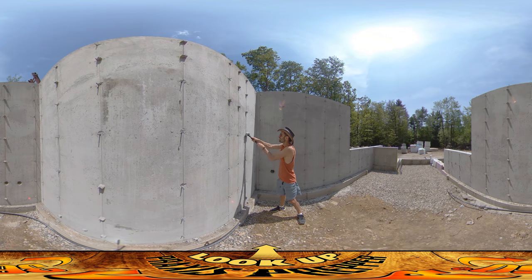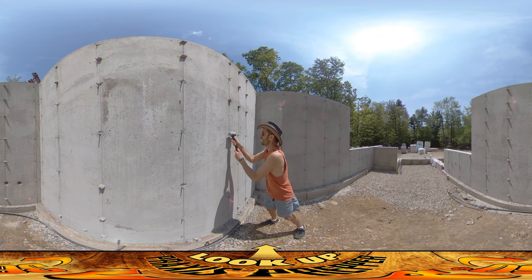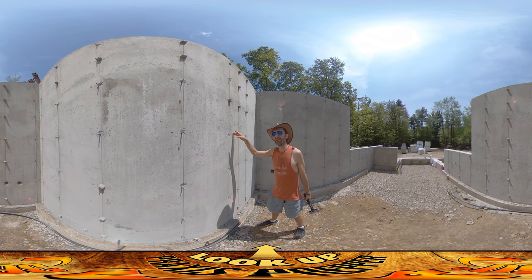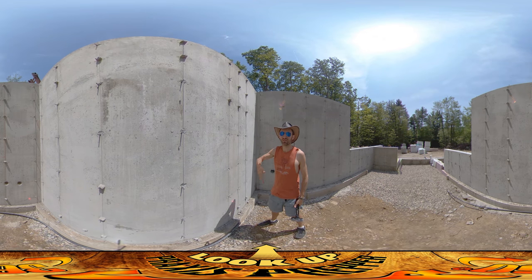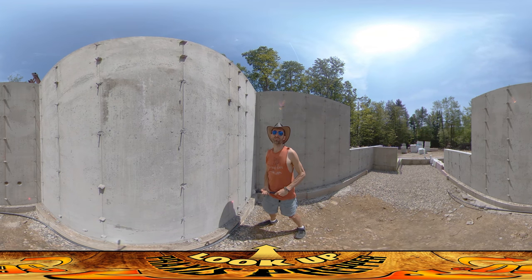Afterwards I'm taking the side of the hammer and wearing down these little lines on the outside of the foundation. I'm doing that so the foam can sit tighter against the wall — if it's bumped out a little bit, it's easier for junk to fall in and wedge the foam out. On the inside I want to smooth it off just so it looks nicer. That's it, thanks for watching.